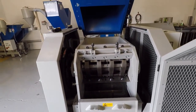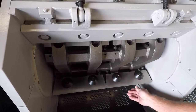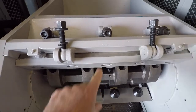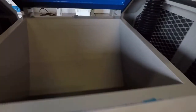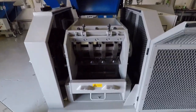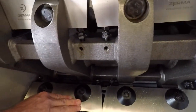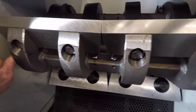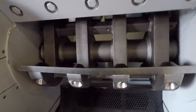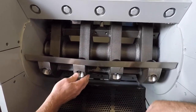This gives you full access to the knives and the screen. These are three-knife rotors with a nice angled cut on them. You have two bed knives — one bed knife at your 10 o'clock position, and one on the lower side of the unit near the screen. It's a heavy-duty rotor, as you can see by the size of it. All the knives are adjustable, which keeps the same cutting diameter throughout the whole process — so whether you've sharpened the knives two, three, or four times, it'll keep the same exact cutting diameter between the knife and the screen.